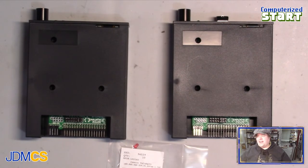Anyways, unfortunately, 32K of SRAM isn't really enough to reliably do an ADF disk image, because that's not enough SRAM to fit an entire track into memory, because on the Amiga, every disk read and write is a track at a time. Even though there are still sectors, there's just no gap between them, so you have to read or write an entire track at a time. Yay, Commodore.